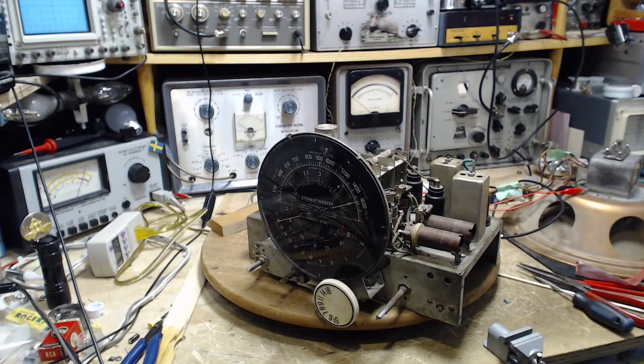Okay, to calibrate the dial, adjust trimmer number 11. Check to see it has been adjusted to the proper peak by tuning the receiver to approximately 15.1. A repeat signal should be heard at this point. If none is present, even with greatly increased oscillator output, retune the receiver to 16 and adjust trimmer 11 to the proper peak with the trimmer screw further out. Oh, you worded that a little difficult. Difficultly. Okay, over again. Calibrate the dial, adjust trimmer number 11.